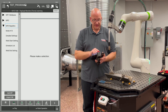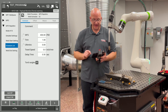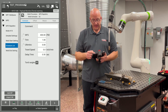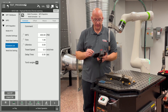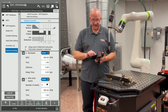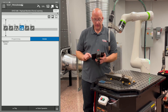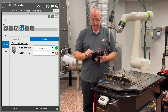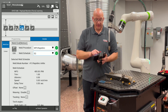Under the Rapid Arc drop-down, go straight to Schedule List and select Schedule Two for the weld end crater fill settings. Highlight Schedule Two, hit Edit — the wire feed speed is approximately half of the weld start speed, trim is set to one, and delay time is about half a second. No travel speed is needed because the robot stops in place at the weld end. Check Weld End Settings — burn back and wire stick settings are good. Hit the back arrow to return to the program and assign weld procedure three, Rapid Arc, with weld schedule two. Schedule one is for the actual weld; schedule two is for the crater fill.